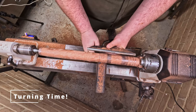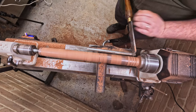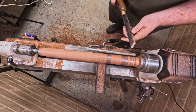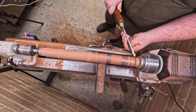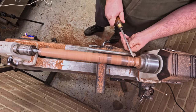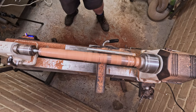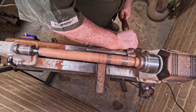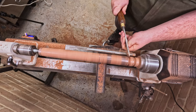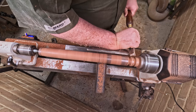Now I'm going to move the tool in and get ready to start cutting. I'm going to start with the pointy side down and create myself a little groove to start working, then flip the tool over and use it to create the bead shape — almost like a bowl shape, a nice rounded semi-circle. I like to use the pointy side down when I am trying to create a cove. I start the tool on a 45-degree angle and sweep with it turning.